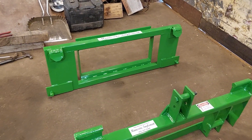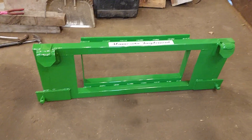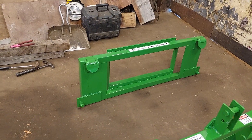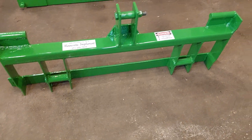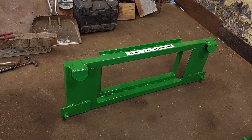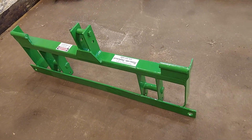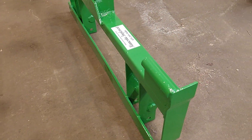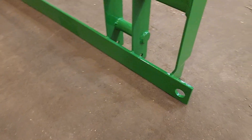This is an adapter for a John Deere hook and pin faceplate — that's a standard hook and pin, the 14 and 3/8 inch smaller faceplate for the John Deere 10, 20, and 30 series tractors. This adapter allows that faceplate — which would be for your pallet forks, hay forks, or whatever else that would normally go on the front — to be used on the rear of the tractor. You can see your hook here goes onto this top dowel pin, and then your pin on the bottom drops through that hole there.